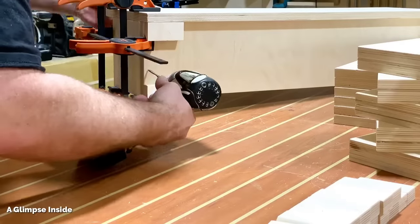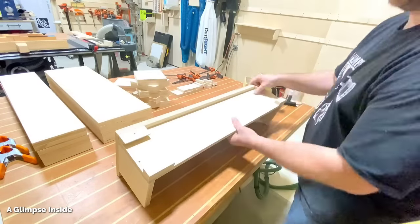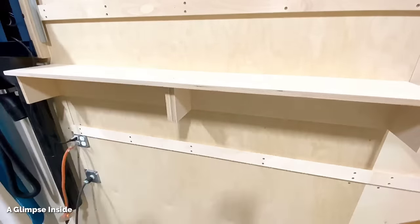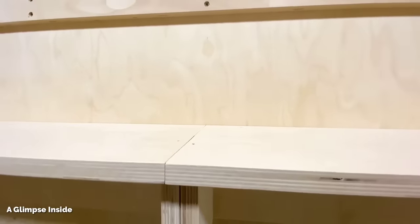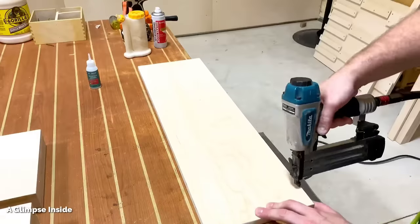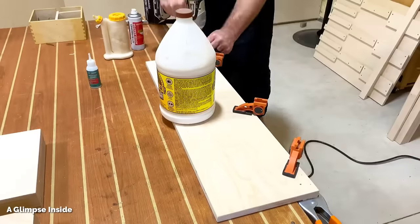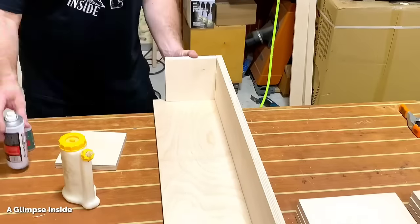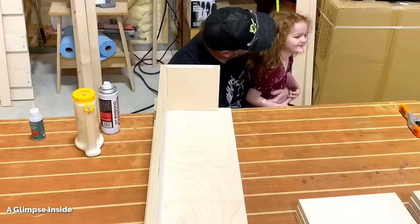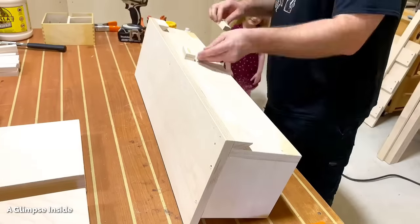Everything's coming together pretty nicely — really simple project. I'm just going to finalize this by putting a small screw in the back of this cleat and then let's test it out. I've got one up on the wall and there's the second — a nice flush fit. You can move these around wherever you want. I built this next shelf a little differently — the cleats are going to be installed on the top of the piece instead of the back, and then the back's going to be installed up against those cleats. Clamp everything in place, use CA glue and regular glue as before, screw everything down, and I'm going to use regular glue and CA glue on the sides instead of clamps.